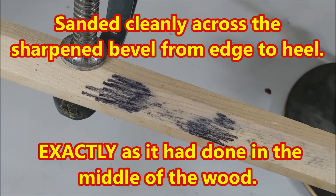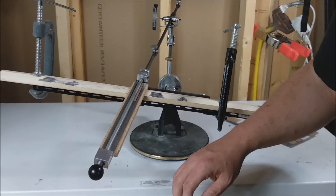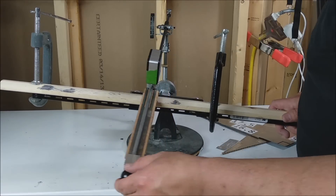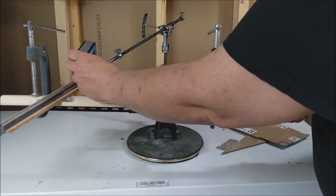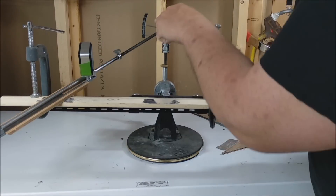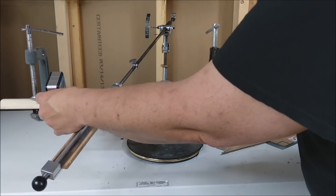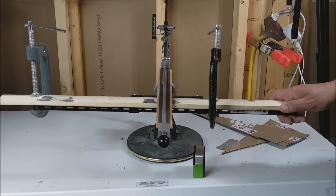I went over here and started sanding at this other position, and I found that it sanded off just as well there as it did there. I didn't go quite as long over here, so that's why there's still a little bit of black residue left. How can that be? The angle is different — if you measure this angle here with your angle finder and move it over here, keeping it horizontal, that number does change. But Jeremy said not if you turn it this way. I figured that was dumb — you're not sharpening this way. But I was wrong. The angle here and the angle here is identical, just like sanding off that black Sharpie proves. The angle does not change.